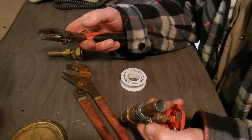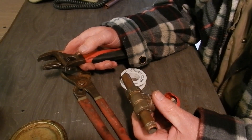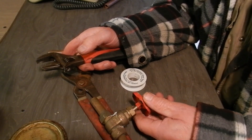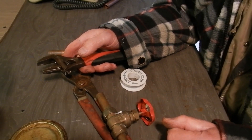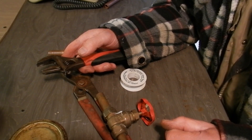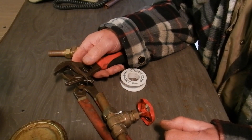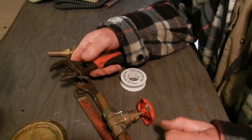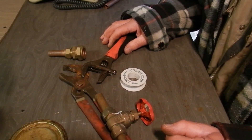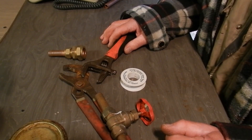Another point came up about cylinder fittings. Quite often you get somebody calling saying their cylinder's leaking, and when you go, it's fitted on the side. They're thinking you can just give it a little nip up and it's done - no, never do that. Never tighten it on the cylinder because you'll come a cropper. It needs draining down, undoing, and looking at what's going wrong. In most cases it's corrosion - the zinc has moved out of the fitting. Just one little turn and whoa - it'll flood in that situation.